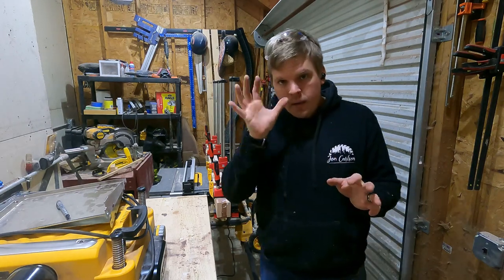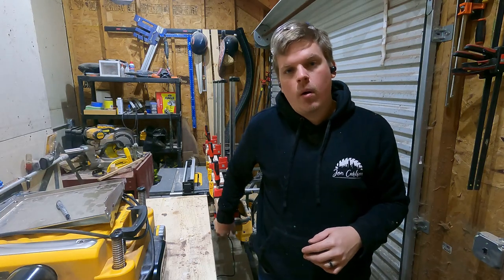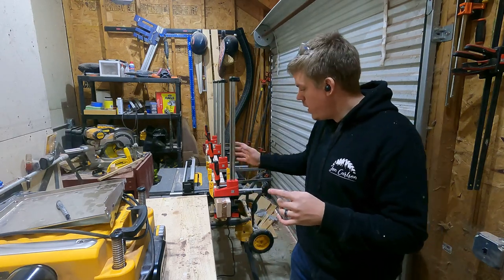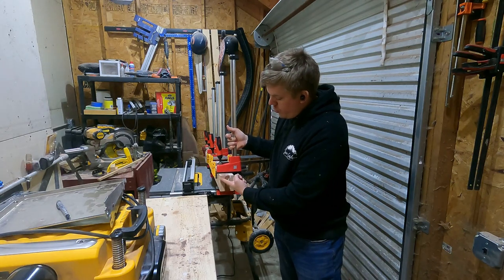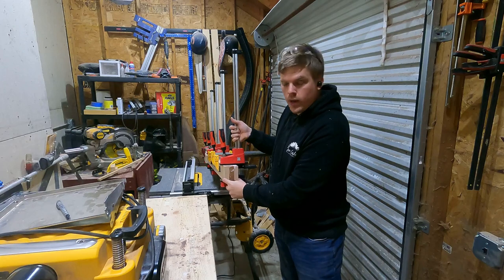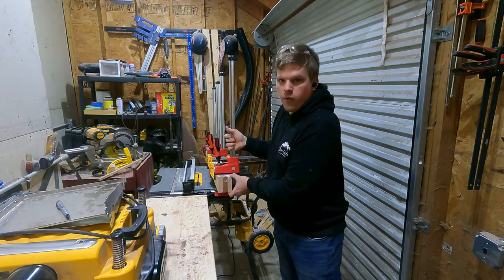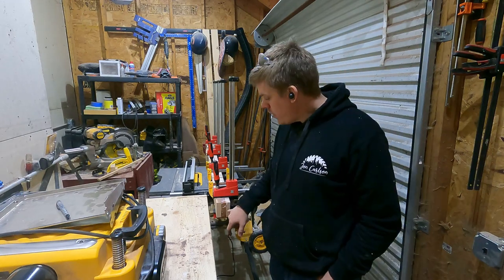Okay, so I'm back. I let the boards glue up and dry overnight. The goal for today is, first, obviously to get everything out of the clamps, but second, to get everything square. I'm real happy with the width on this right now. I'm just at 3 inches there, which I'm good with. But it's this dimension here, the vertical dimension, that's over. I did that on purpose.